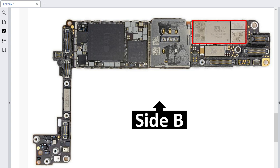Over here, this one is not an IC — this is the clock crystal, for timing and clock. The purpose of the clock in every motherboard is to synchronize the work between all components. Without the clock or timing, nothing will work properly. Then we have this IC — we call it the inductor IC. Around it we have these ceramic capacitors. If this IC is bad or shorted, you're going to find both ceramic capacitors shorted also. If this inductor IC is damaged, that means no sound, no charging, and no backlights.